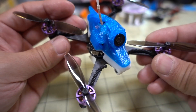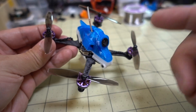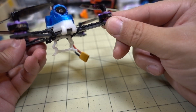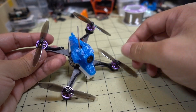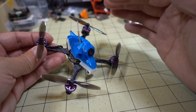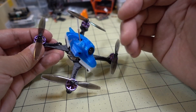In terms of performance, it seems totally fine — no real complaints. Much better flight time, and this motor does seem to have more torque, so it does seem more responsive. Overall, I would recommend this motor over the 0802 if you happen to do this upgrade to the Carrera frame for the Mobula 7. Definitely consider getting these motors — they're pretty inexpensive. Very good performance, very good flight time. Fairly acrobatic on 2S, and I didn't have to change the tune either — same tune I was running on the 0802.